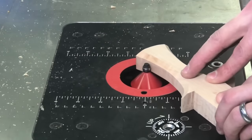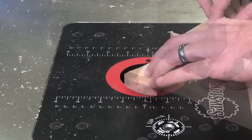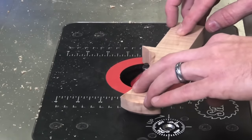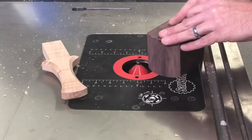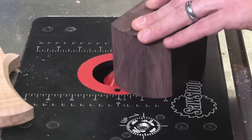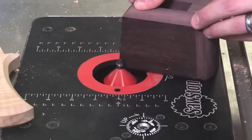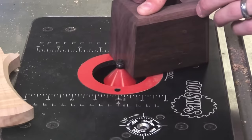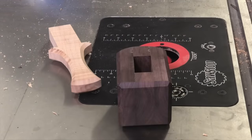For no particular reason I'm doing a 45-degree chamfer on all the edges — I'll do this on the handle and also on the mallet head itself. This is just for looks; a lot of mallets do round-overs but for this one I decided to do the chamfer bit. Anytime you're freehand routing just try to be as careful as you can. This is one time I will always wear my eye protection — the router does scare me a little bit.